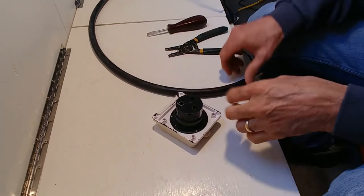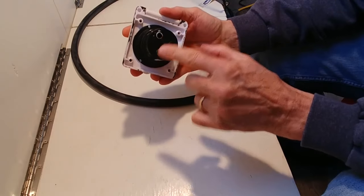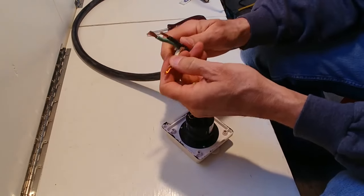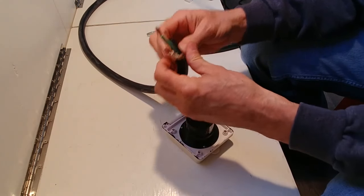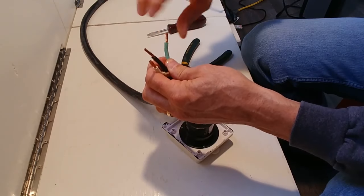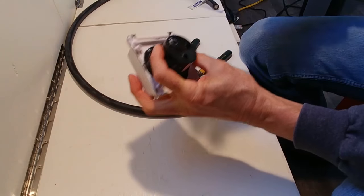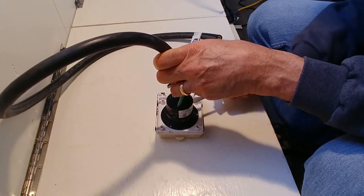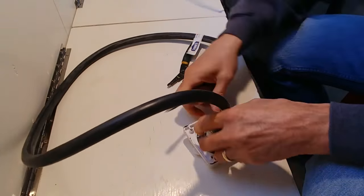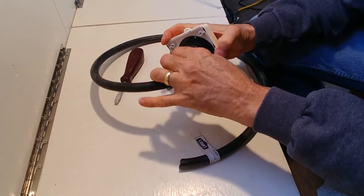Our first step is to install these three wires into the power port. I've got a white one, green, and black — color-coded — and obviously we've got white, green, and black wires to match. I strip off about a half-inch to five-eighths of insulation using a stripper tool, twist them up really good, make sure the screws are backed off so it's all open, then tighten the screw up on the outside to pinch the wire. Give them the tug test to make sure they're all tight.